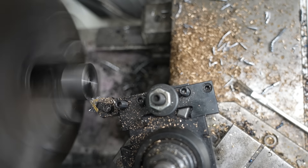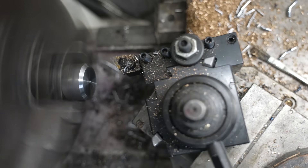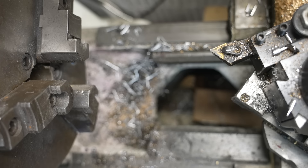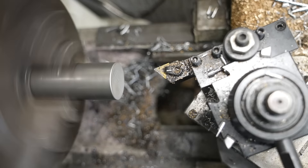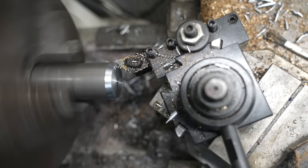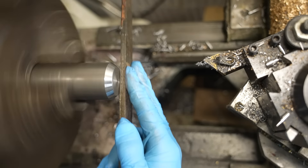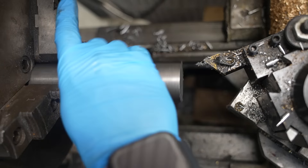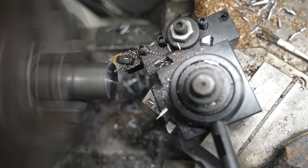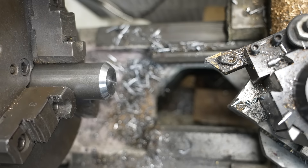The concept for this hinge: the steel bar gets welded to a plate, and then that little slug that I'm turning down on the lathe gets welded inside the tube. I'm using an inch and a quarter solid steel ball, and that's going to actually be the roller that reduces the friction and allows the doors to pivot. These doors are going to be really large — about 16 feet tall and about 4 feet wide — so you're going to need something really substantial to make them pivot without a ton of resistance.